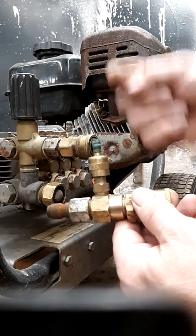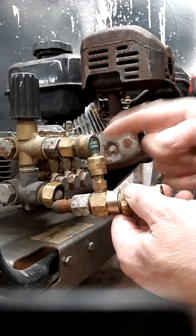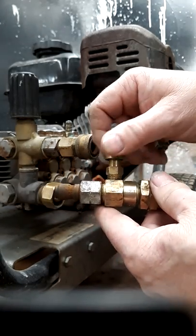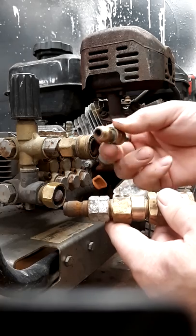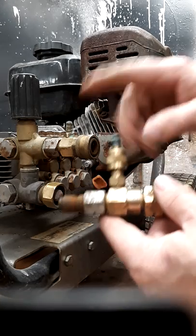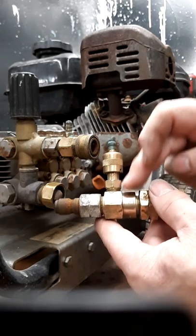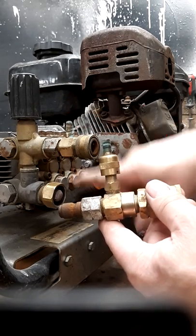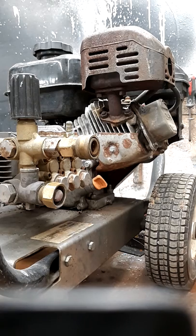You'll see your chemical coming up through the hose into the unit. If you set it all up and don't see chemical flowing, you've got an issue — we'll get to that in a minute. If you have to take the injector apart, be careful: the spring is very thin and easy to lose, and the ball can get stuck. On this one the ball is stuck, so it would have to be freed to work properly. When pressure drops, the ball siphons down against the spring and opens the port.